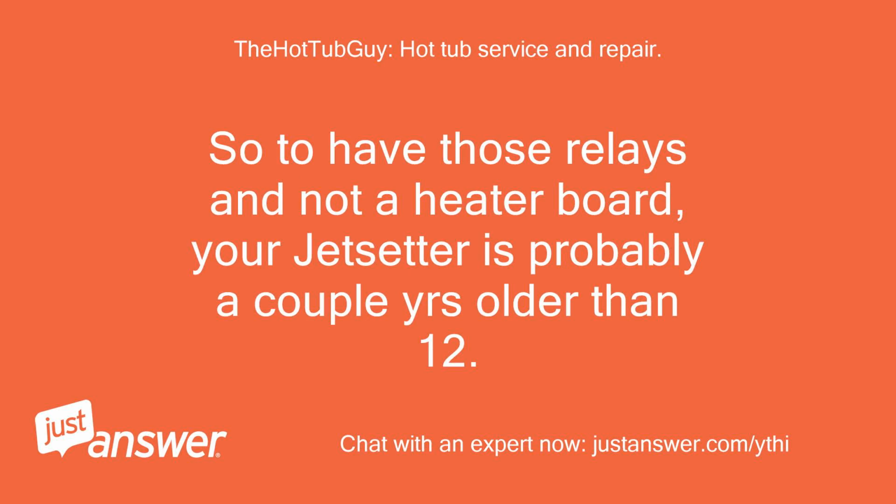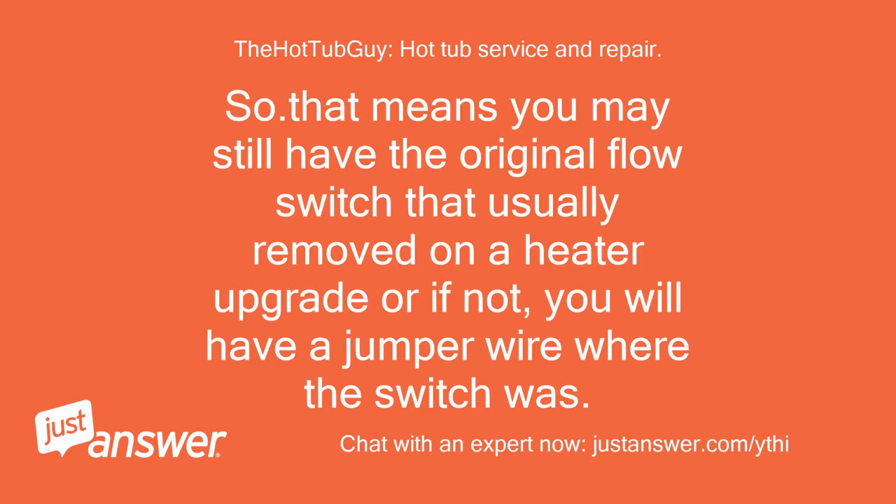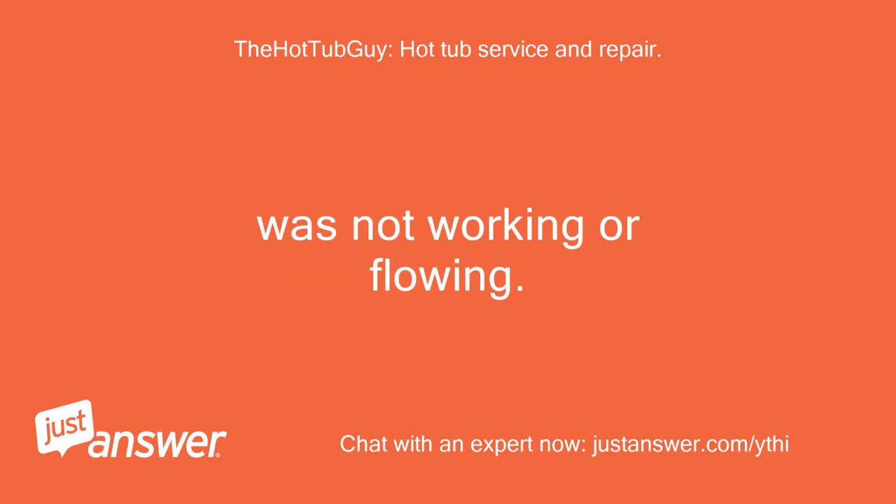So to have those relays and not a heater board, your Jetsetter is probably a couple years older than 12. Maybe '99 or '00. So that means you may still have the original flow switch that usually is removed on a heater upgrade, or if not, you will have a jumper wire where the switch was. This would explain the no heat if the circ was not working or flowing.